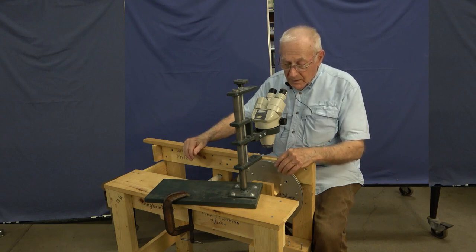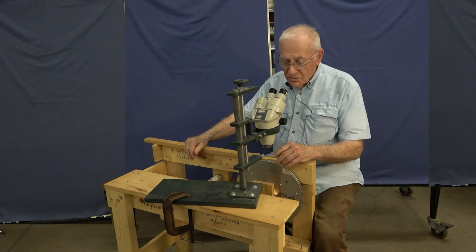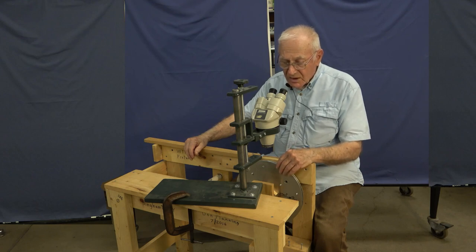And then, once you have the tape on, you take the mandrel out and take one side off, and loosen the two halves that are still in there so you can slide them together, and that will release the tape to come off very easily. It won't come off unless you actually move the internal halves together to release the tension on it. But then you should have a good band. Handle it with great care, no kinks, because then you have to work on the next process of actually installing the slugs on it.